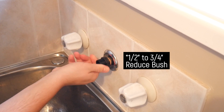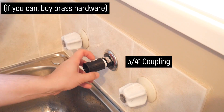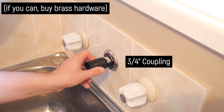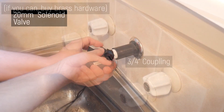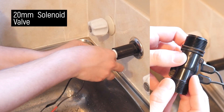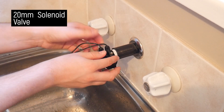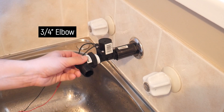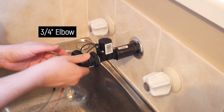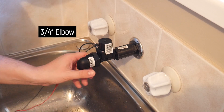To adapt from a wall-mounted spigot, I used a half-inch to three-quarter inch adapter, which I then threaded into a three-quarter inch female coupler. If you can get a brass version of this coupler, I would, as it felt a little flimsy. The valve was then tightened into place, making sure the arrow faces the direction of water flow. Twisting into place will twist the wires a little, but they're very long so it's not much to worry about. Because we're replacing the tap entirely, I used a three-quarter elbow joint and end cap for the outlet. You don't strictly need the end cap; however, it does a great job of improving and concentrating the flow.